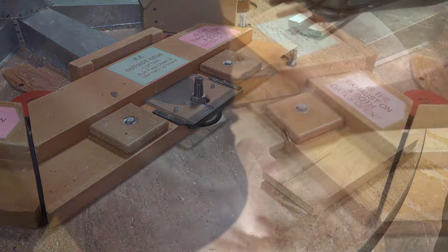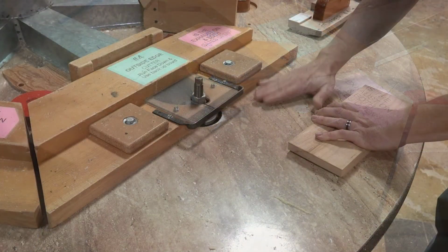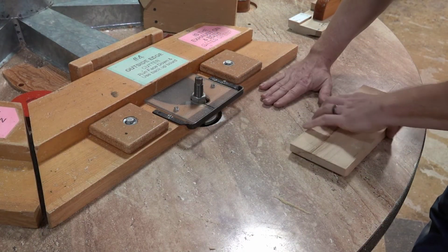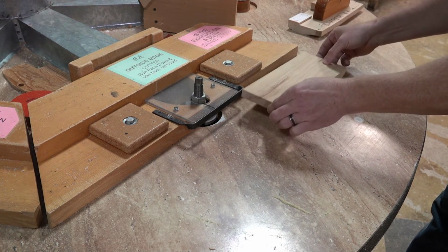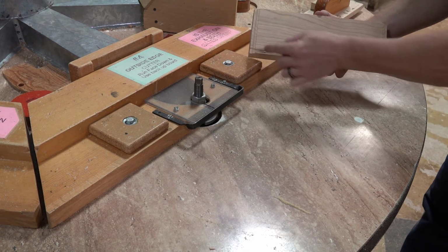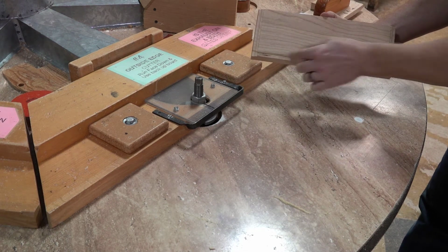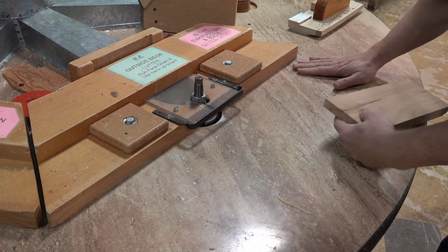Now, as you're cutting, a lot of sawdust is going to appear on the table. Depending on the shaper, you'll get more or less. It just depends on which one you're using. Now, if I have a pile of sawdust under the board, I put the board on top. Now my board isn't sitting flat, it's going to wobble because there's a mountain of something underneath it. It won't be able to cut as deep as it's supposed to. It won't be nice and clean. So make sure to blow the sawdust away.